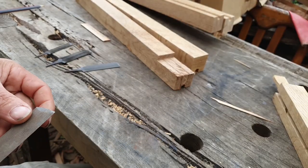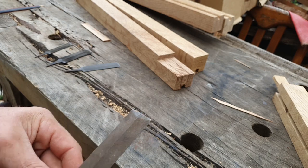In practice that means you joint not every time you sharpen, but regularly, depending upon how even you are with your sharpening of the teeth, so that you don't create unevenness in the tooth length in the first place. I've got a selection of Japanese feather files here — these are for saw sharpening.